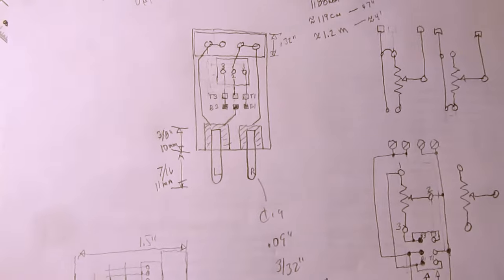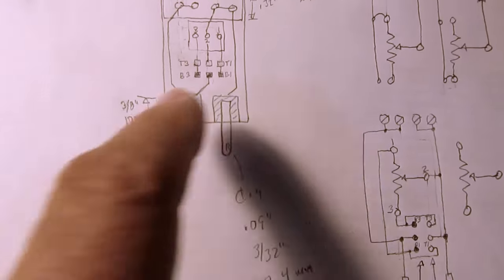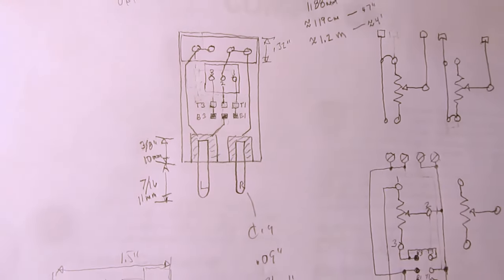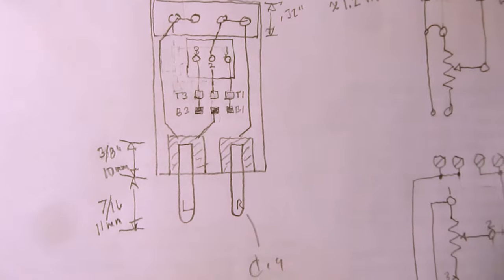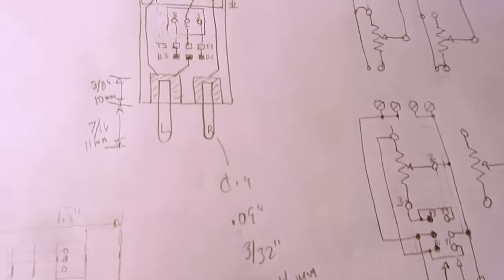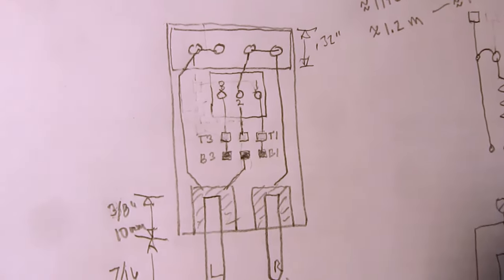So I decided, well, I'm going to set this up to be safe in operation for 200 volts, so that nothing will arc over or anything if you applied 200 volts across the pins. So I had to make sure I selected a potentiometer whose pins were still according to the, I forget what it is now, the IPC2221 guideline that's widely used for circuit board design.